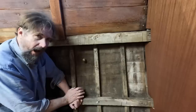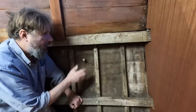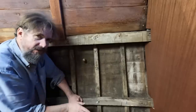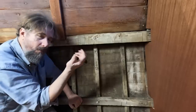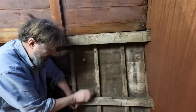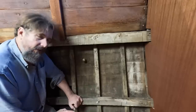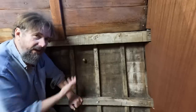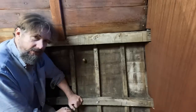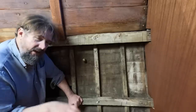All the boats that I'm interested in, in other words, Geordie, Zephyrus, and Poem here, I force ventilate by actually extracting air from the bilge. And what that'll do is reverse this basic process and suck dry, warm air from inside the cabin down in behind and down against all this planking into the bilge and away. I think that has a bunch of advantages. One, it doesn't bring bilge air into the boat. Two, it brings the driest possible air in to do the ventilation. And three, it provides really good ventilation in the engine space.